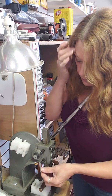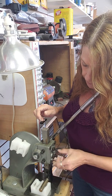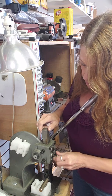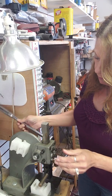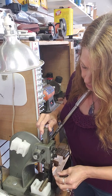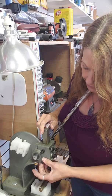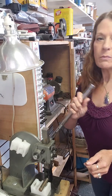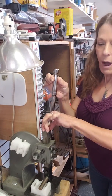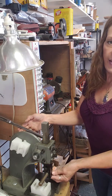You can see I've got wobble here, so I want to adjust the screws. What you do is bring them in until you do not have any more wobble. You don't want them so tight that you can't move the bar or slide the bar up and down. Once you've got that tight to where you're not getting any more wobble, then you want to advance the nut until it touches the arbor press, and that will keep the screws from backing out. So now you have a nice smooth, fluid motion without any wobble in the attachment — you can see there's a big difference now. I can't wobble this attachment any longer.